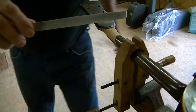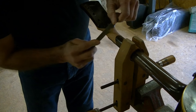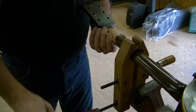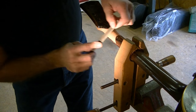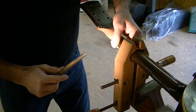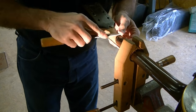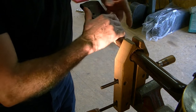I've got a much smaller double-cut file now — it's a pretty smooth file, still good for shaping, and it'll let me get rid of some of the bigger marks and bring it down with more control. I put a flashlight on it for the moment so I can see the detail better. If this is done correctly, you won't even feel this joint — and it's already starting to go away, I can tell it's just about gone already. I think that's about all I'm gonna do in this room. I'm gonna take it back to the bench and do the real fine shaping now.